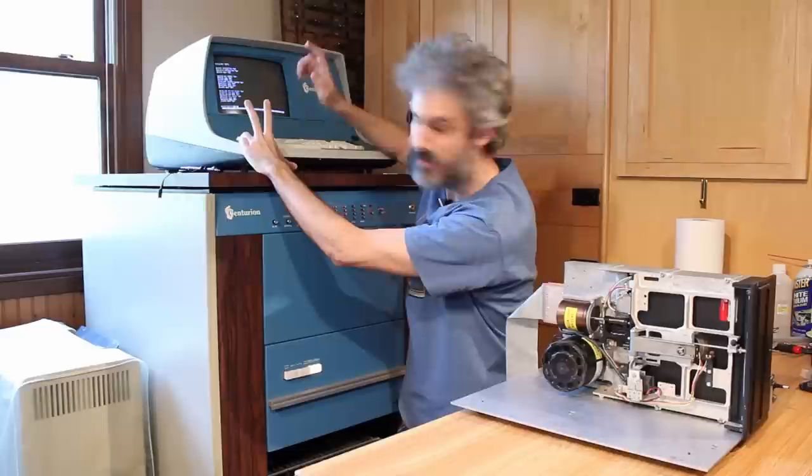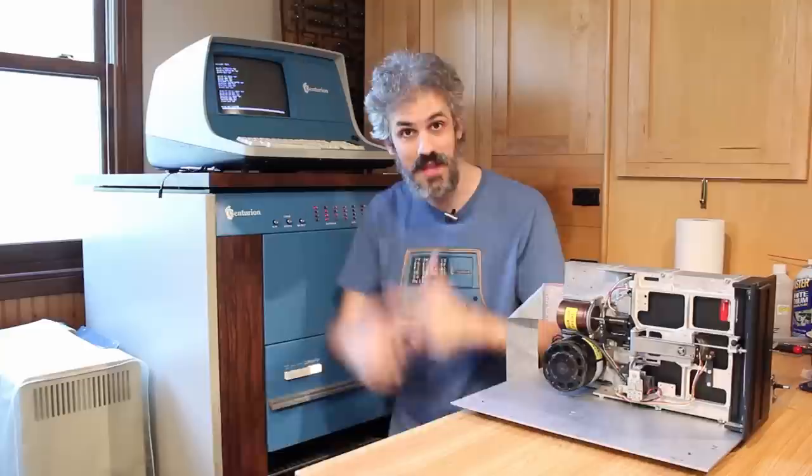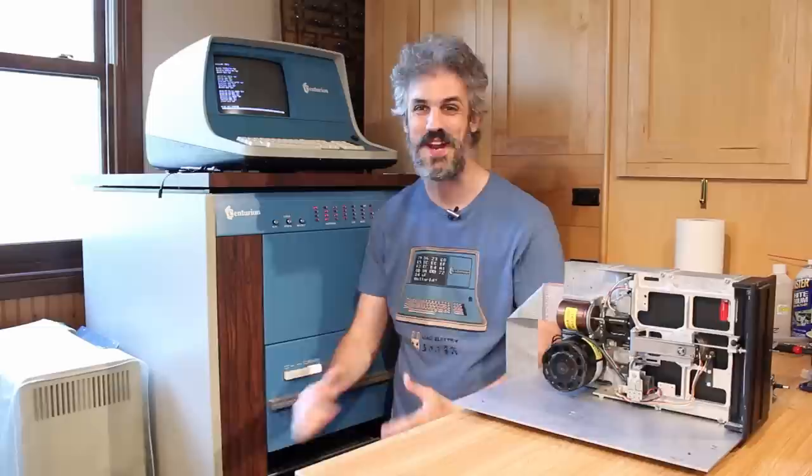Yeah, there it goes. Okay, so it came all the way back to track zero, hit the track zero switch, sent track zero information to the FFC card. That completed the full seek test, which was all the way out and all the way back. It passed and got me back to the menu here. That is awesome. All right, let's try the floppy read test, 09.